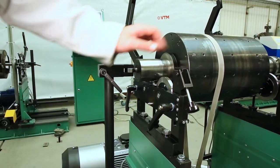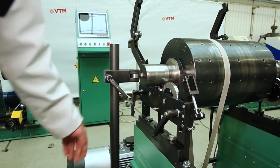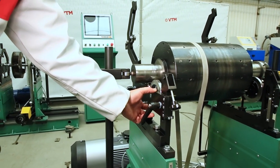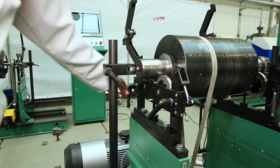In order to install the rotor horizontally, we loosen the fasteners and by moving and turning this nut, we move the roller block up or down. After installation, we fix it back and clamp the stops.